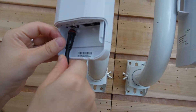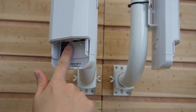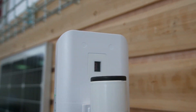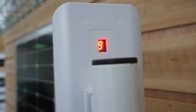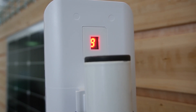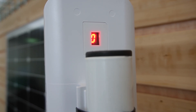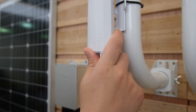This is one pair of the wireless bridge — it accepts 12V power input. And this is our reset button. We are going to use this to configure the channel number on the back. I am going to turn it around. Here we go, we have the channel numbers showing. I am going to press the button to change the channel — so now we are on channel 1.